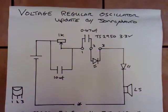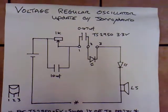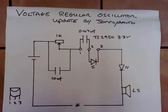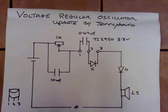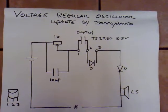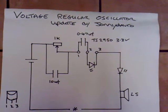I was thinking about it the other day, dug it out and had a play with it. I've got it working so you can use any input voltage up to the maximum rating of the voltage regulator — I've had it running on 18 volts. You also get the full output from the regulator: 3.3 volts from pin 3 in the case of the 3.3 volt regulator, or 5 volts for the 5 volt one.